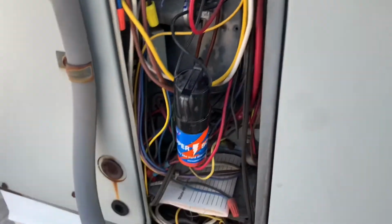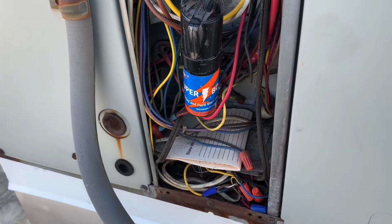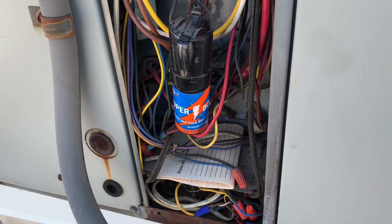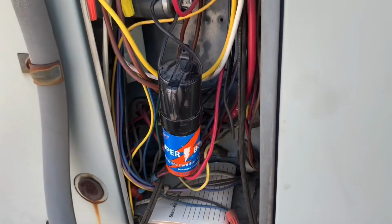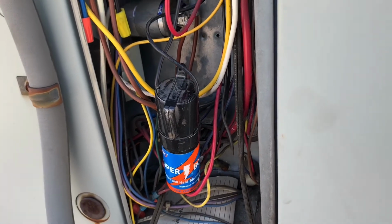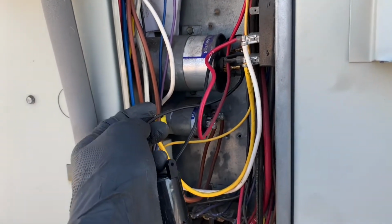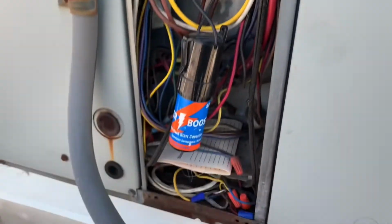The term HERM derives from the word hermetically. And hermetically, we're talking about a hermetically sealed compressor. All right, so HERM is for the compressor, and FAN is going to say fan, that's the condensing fan, and C is the common. So you'll put one wire on C, and the other wire you stick it on the HERM, which is the compressor terminal. I think I have a schematic here.